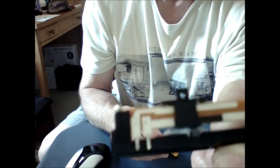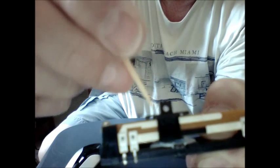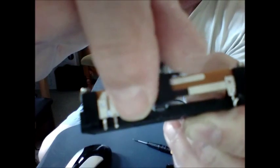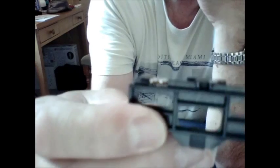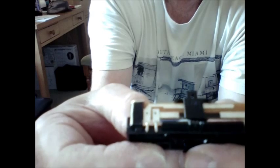We are going to remount the potentiometer board that we took off, having removed the plastic block that the joystick probe went into. We push that down on top of the device. Make sure the slider is over the device itself, then tighten the end screws to hold the board down — just remember to slide the clip round. This gives us a nice firm assembly for our device, as long as that slider is over the top of the device. And that's the mounting assembly for the hall sensor.